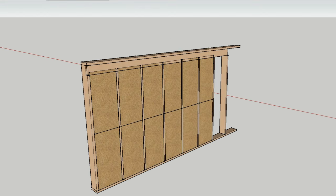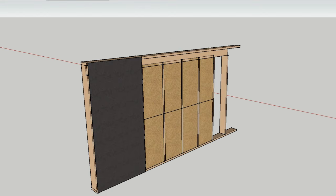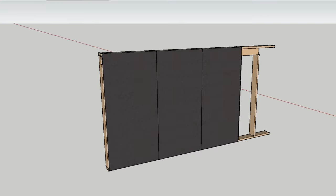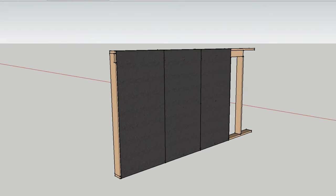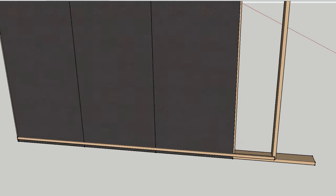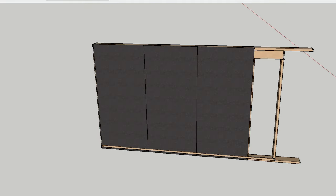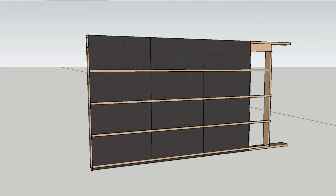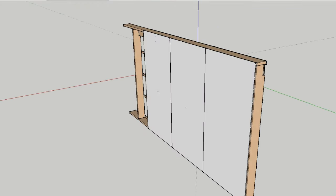On the other side of the wall I want panels for wind protection. These panels are also adapted to CC 60 and are 120 centimeters wide. On the wind protection I want studs for the wall panels, so I make sure to buy studs that follow the CC 60 measurement — in my case 240 centimeters long — so that the joints end up in the middle of the wall studs.